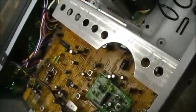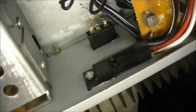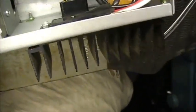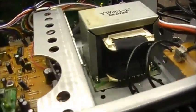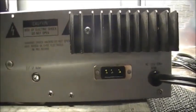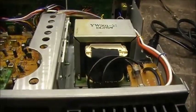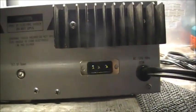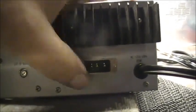This radio also has a major overheating issue. I had to move the power transistor and put a heat sink on the back of the radio to compensate for the heat. She has a pretty good whine on receiving and transmits, and it has something to do with the power supply — I don't know exactly what. I tried running DC external power and the noise was gone. So it is the power supply circuit here that's causing the grief. Until I get that fixed, since I still want to use the radio, I put my own DC line in here.